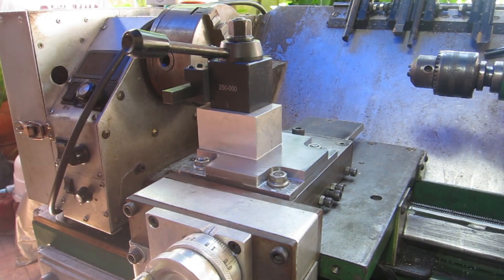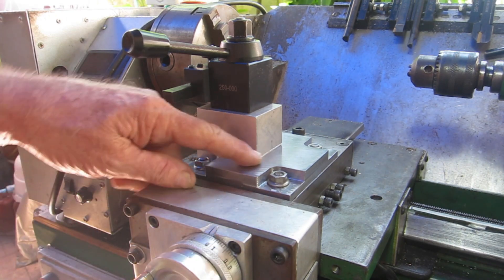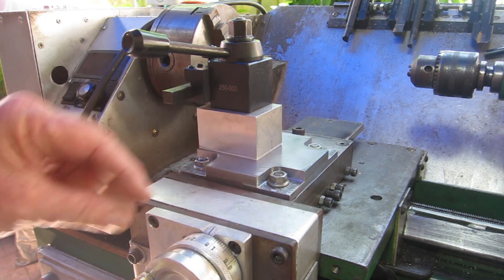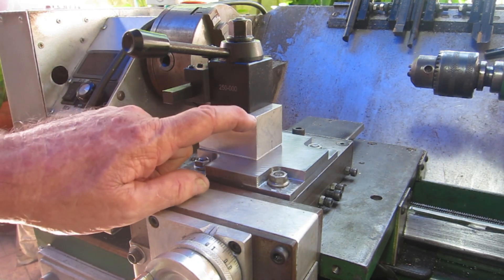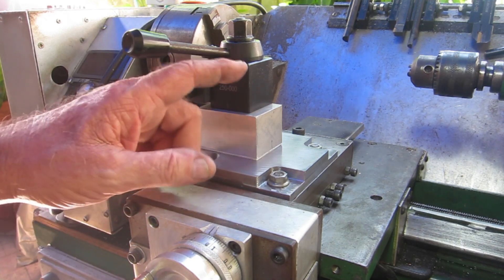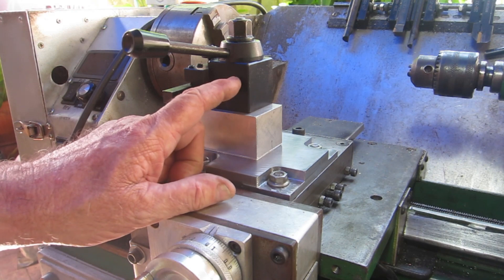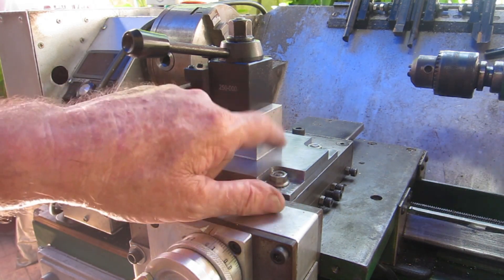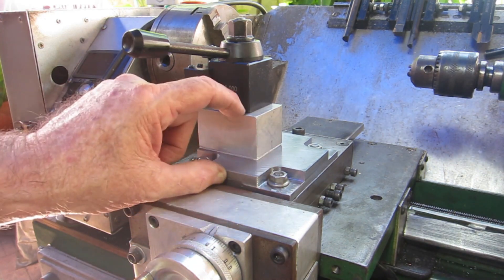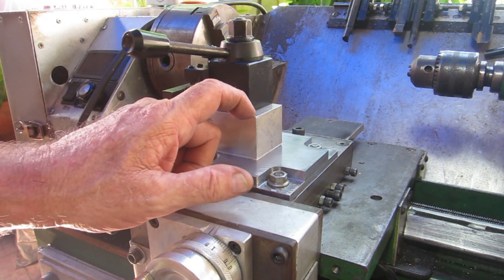If you've been enjoying this video do me a favor and smash that like button. A little bit of miscalculation before — when I said it might take two shims to get up to the right height, I've only got one in there and I need to take 0.4 of a millimeter off the top to get it down to the same height as the mounting point for the quick change on the other one. So next up I'll drill and tap a couple of holes in the bottom, bolt it all together so it's one piece, then flip it over and take 0.4mm off the top.